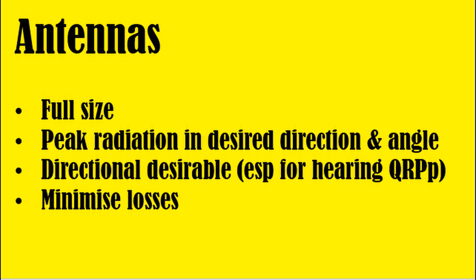Then there's the antenna itself. For HF with long distances, you generally want a low angle of radiation. Something like a dipole can be okay, but it needs to be quite high relative to its wavelength to get that low angle. If you've got saltwater around, a vertical right near it — and it does need to be right near it or over it — can also give you a low takeoff angle, which is good for DX. If you're not seeking the furthest distances, like only a few hundred kilometres, you don't necessarily need the lowest takeoff angle. In some cases a very high antenna may be counterproductive, and even something like a low dipole can be quite good.